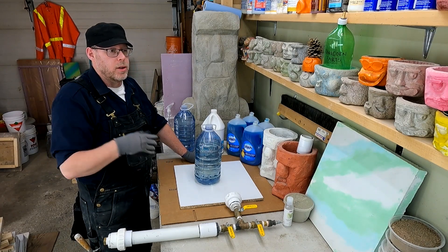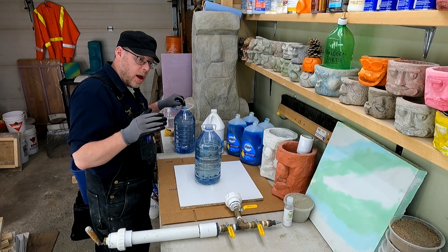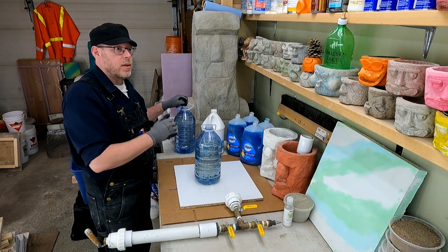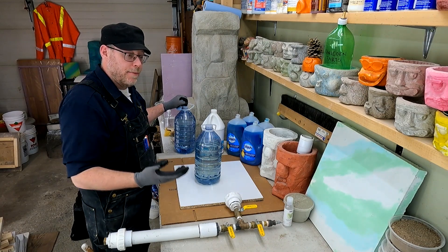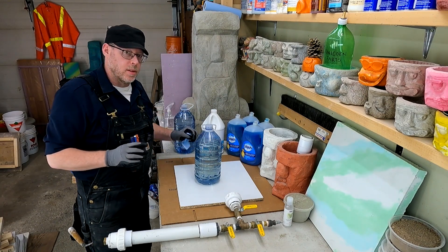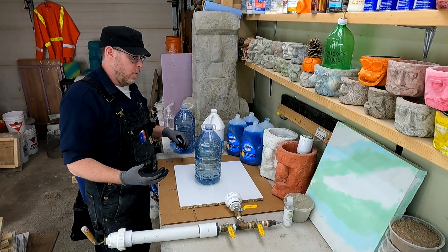Super not ideal if we're making aircrete. So that's why I'm using rainwater to generate my suds, but I'm using tap water with a high level of calcium hardness in my cement-water mixture. That way I'll hopefully have a pretty fast set time for my mix.